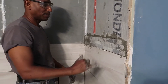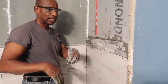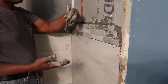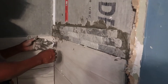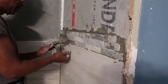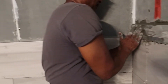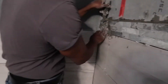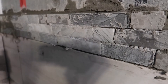Joe went back to the store where he bought the decorative piece, and they advised him to put some thinset on the back and let it dry overnight. Next day, put some more on it and some on the rock board, and it should work fine — and that's what happened. So he basically built up the tile thickness. He's running one decorative roll going around the wall. You don't have to do this when tiling your wall, but we wanted to break up the monotony of the tile.